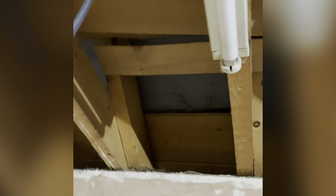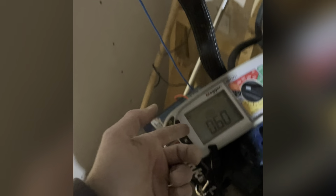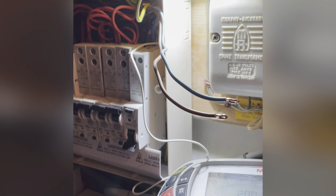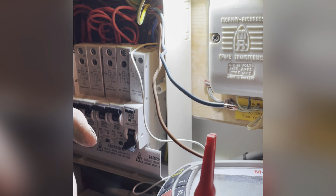I'll check the other one now — this one down here. I'll test them all but just for reference I've just gone to the end of line to show you. Right — nothing there, but if I flick this — it's a new switch — I ran in from the consumer unit through trunking in the garage down the stud wall. Hopefully when I flick this we should hear a noise. Lovely. This will effectively be our highest reading because this is the furthest part of the circuit, with five or six joints before then. Done. Now on R2, I've put the two Kewtech plugs back together. I'm going to do an insulation resistance test now — I'm going to blast it. I'm going between line and neutral, blasting it on 500 volts because I know I've just installed the circuit and I've got no problems with it.